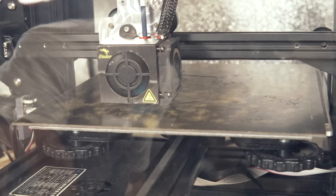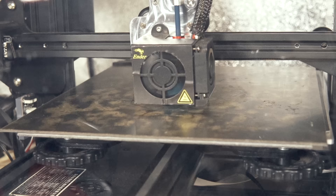When I started the print, I noticed the filament wasn't sticking well to the PEI, which I found odd. Looking more closely, I saw residue from previous prints. I grabbed some IPA on a paper towel, did a quick wipe-down of the PEI, restarted the print, and the build plate adhesion was significantly better. That's something to remember — good 3D printing maintenance matters. If you touch your PEI, you've got oils from your fingers, so having a clean build plate is very important for proper adhesion.